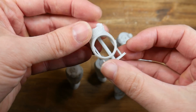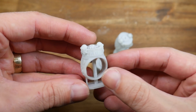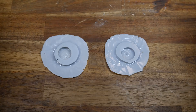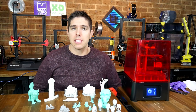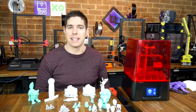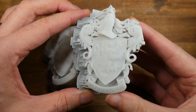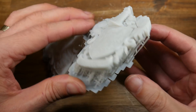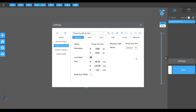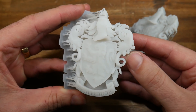First up were these sets of rings found on the USB drive. They printed quite flawlessly in Frozen ABS light grey with lots of fine detail and clarity. Next up I went for these moon cities but they were a complete failure — I was guessing on layer times, didn't have it long enough, so midway through the print it delaminated. I tweaked the curing time per layer and then printed these bag tags for my daughter. The curing times were close enough to get it printed successfully, but the text came out mirrored, so I learned that in the slicer I had to tick a box to get the prints to come out the correct way. Apart from that I'm happy with the detail of the print, and the bonus is my daughter is too.